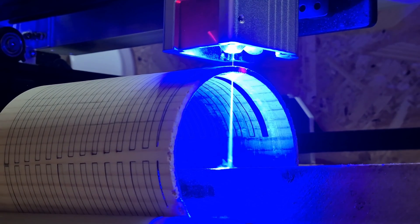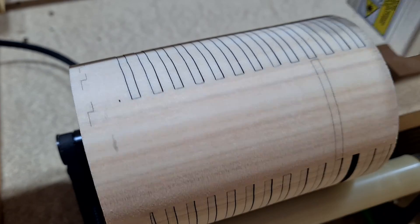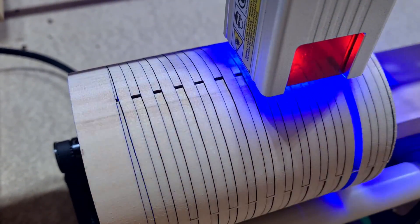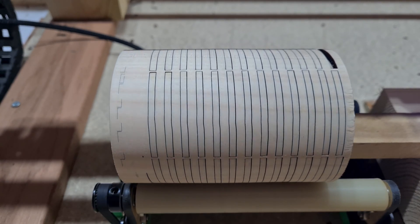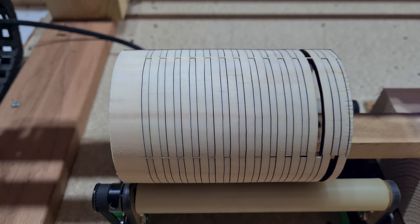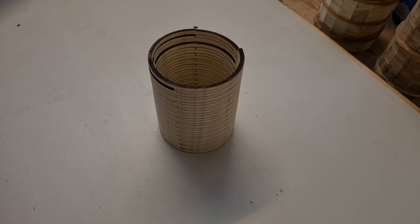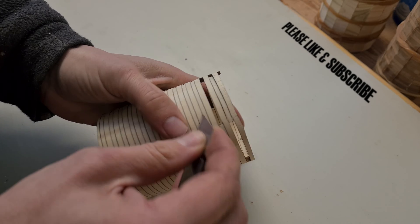This shot somewhat reminds me of the scene in Independence Day — you know the one where you're shouting at the rooftops full of people staring at the blue light and not running? I'll give you the 360-degree tour of the cylinder. Basically it cut well — the lines have joined up and should produce a more robust spiral. I'm thinking maybe I could have put a lighter cut between the adjacent horizontal sections to aid removal of the spine supports, but they needed to be in place, otherwise the spiral would unravel onto the rollers and no further cutting would be possible.